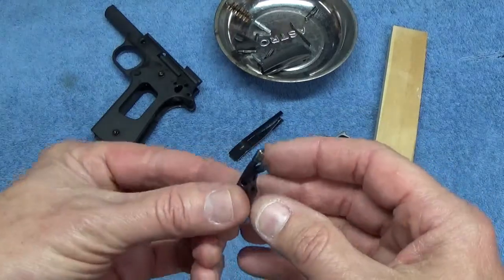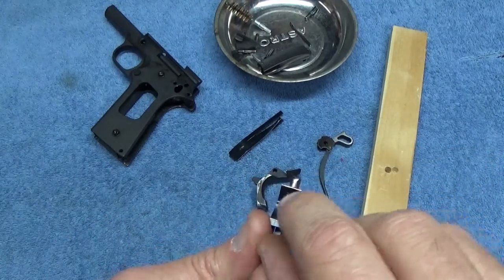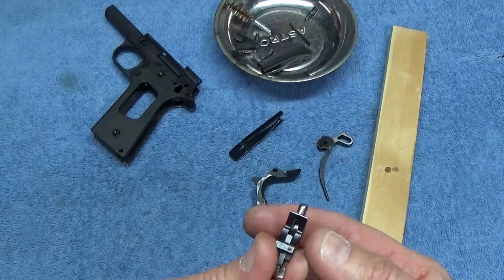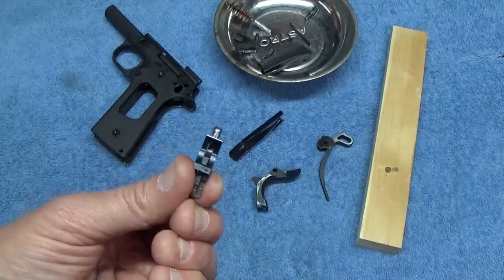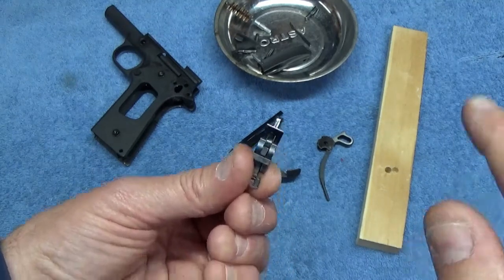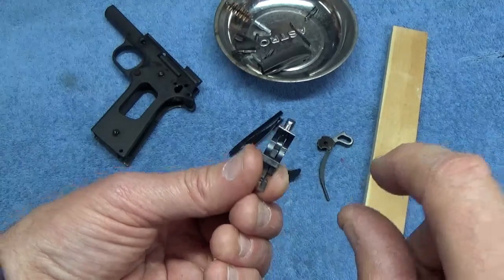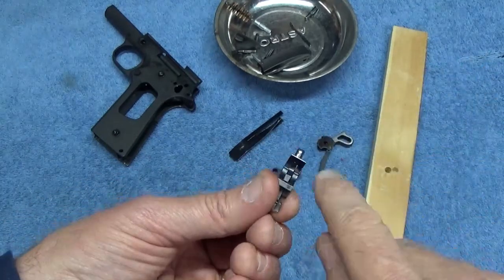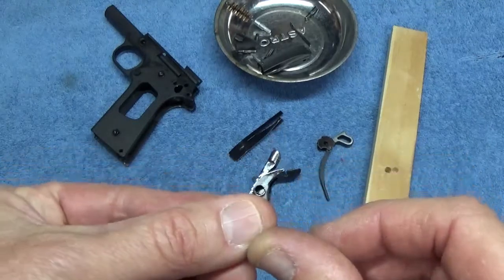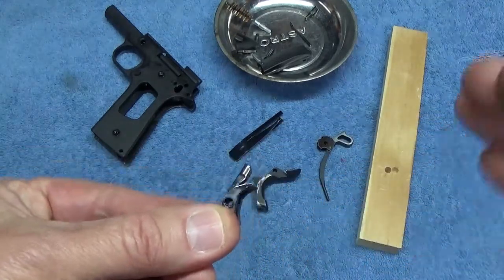This is my new sear that I just got. On the very tip, you can barely see a little silver line — a little shiny line right there. That's all I polished — that little shiny silver line. The sear angles were already cut. I've never done a trigger before or any sear work on a 1911, so I was very careful. I took two or three soft rubs on this sear with a 900 grit ceramic stone, looking at it through a magnifying glass, just to rub a little bit of the black material that was there on that angle. When you look close under magnification, there's an angle cut on the backside and an angle cut on the front side — one is at 60 degrees, one is at 40 degrees.